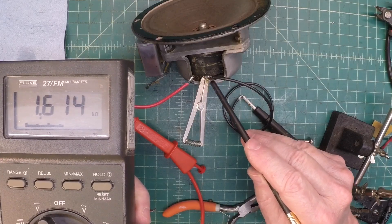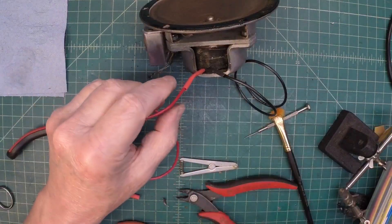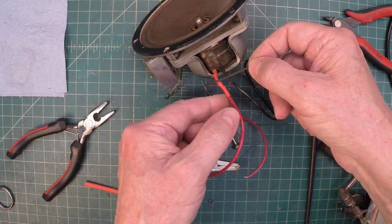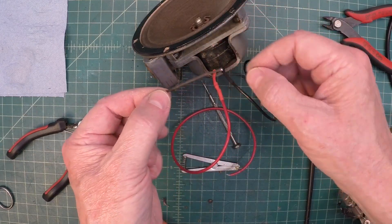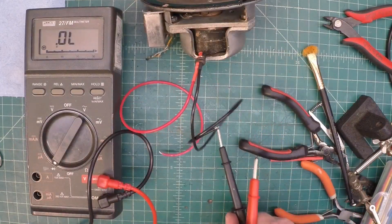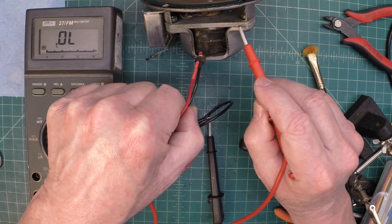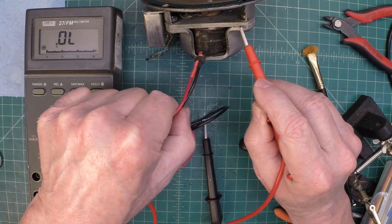We may have to take some additional steps here to help mitigate that. I might get lucky here. I'm going to take some of my brown pushback wire and just create a tie for this point — more of a strain relief — to keep the two conductors close together. I'm attached to the black lead in continuity mode. I just want to move this around and go back up against the frame of the speaker to make sure I don't see continuity there.